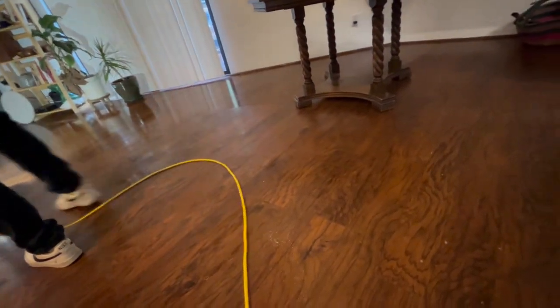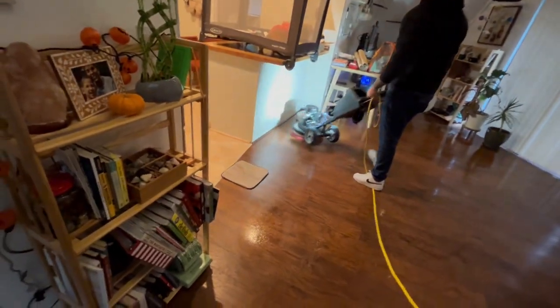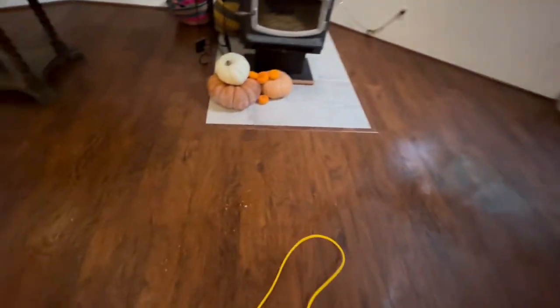The procedure we're doing today is basically just a clean and buff, or a clean and shine. There's no acrylic polishes or anything being applied, no polyurethane. Both floors had no buildup. She's been using a neutral pH cleaner, which is fantastic — makes these things easier.